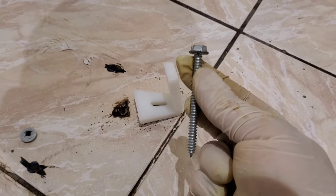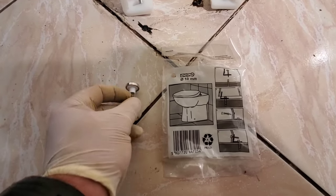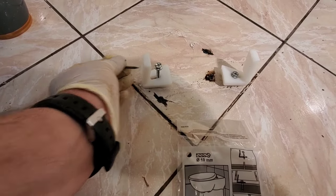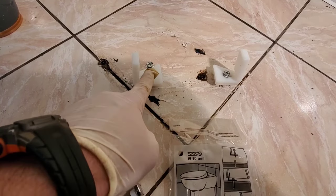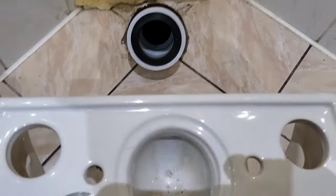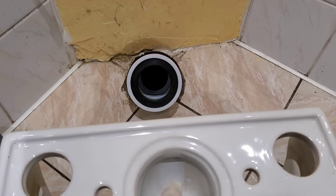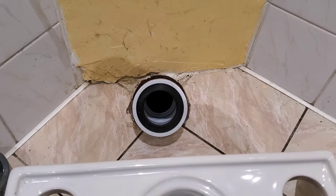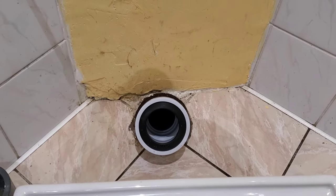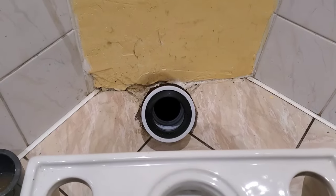I made a mistake — based on the detailed instructions, these white caps are for the covers for the screws that go in on the horizontal. I've already put the one bolt down, so I'm going to take a ratchet and tighten this one down. We have the two blocks there. The toilet goes up over onto the blocks, the tube goes onto the outlet, and I'll screw in the screws — just get them started into the blocks. Once that's all done, I'm going to test the connection between here and the toilet to make sure nothing is leaking before going any further.